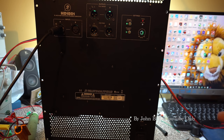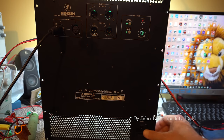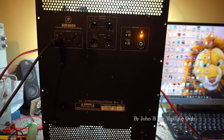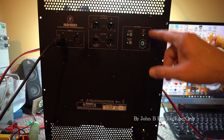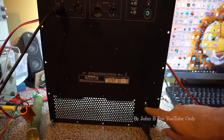Right, so we're definitely getting somewhere. That transistor, definitely wrong type. So I'll swap that back over, put the discharge resistor back in on that 556 circuit. So turn the power on. Just had a click. So those timers will be used to bring on these lights to test them and then knock them off. And as they go off, the power comes on.